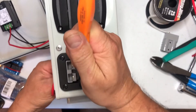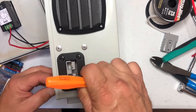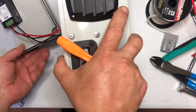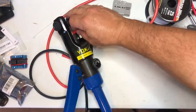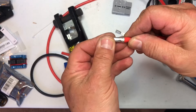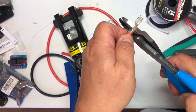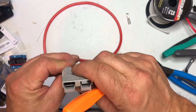I find it a little difficult to get those slid in, so I use a screwdriver to help slide them in until they snap in. This is the other side of the Anderson plug. I noticed that crimper didn't get it tight enough, so I just used the channel lock one to finish it.